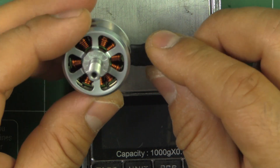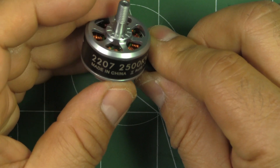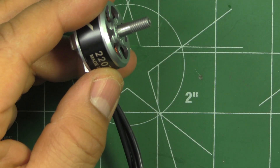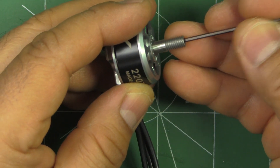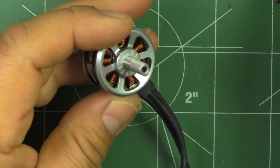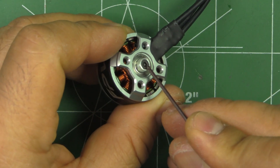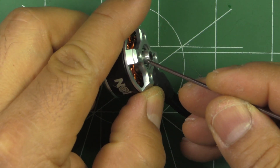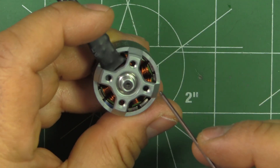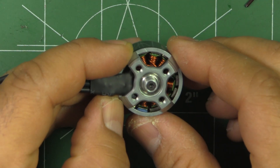But overall the motor does look pretty good — nice polished aluminum finish, and it's pretty nicely finished. They are using a single piece shaft, and this is hardened steel, and it's partially hollow — only hollow down to where it meets the bell. They are using a retaining screw with an aluminum washer where the screw goes in, so there's no brass washer. It looks like the magnets are curved, and I'd say it has a standard air gap — not overly tight and not too loose either.